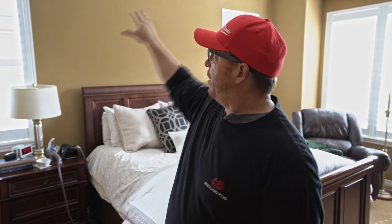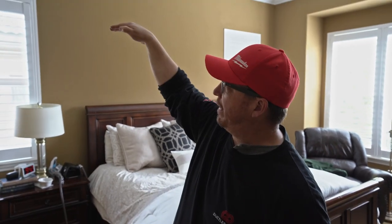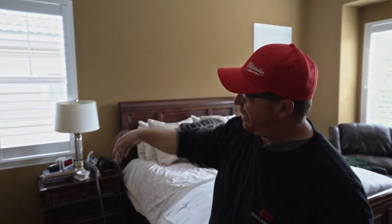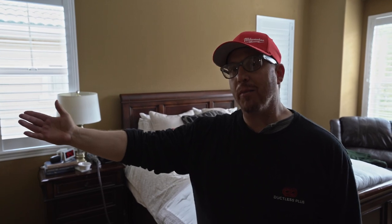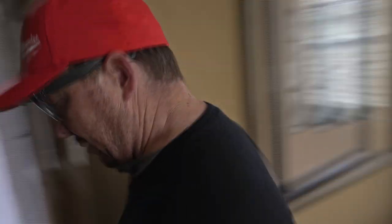So he was thinking about possibly putting a wall unit above this window, and then you would have a hole right there going down with the line hide. Then you'd have a bunch of line hide coming out. That would look kind of ugly. So we did a little thinking about this one. He didn't want any pipe on the outside of the house. So what we're doing is we're gonna take all the pipe into the garage, and then we're gonna run down that exterior wall and out. So anywho, follow me. We're gonna go outside really quick, and I'll show you where the condenser sets.